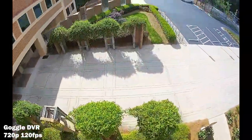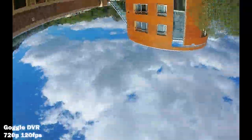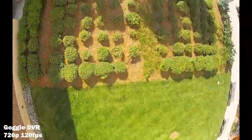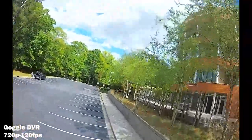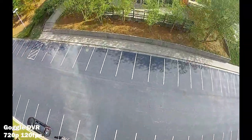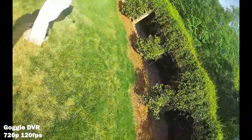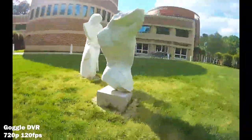After updating the firmware recently, I noticed a few new features, including ranging mode. Ranging mode allows these goggles and transmission system to estimate how far away your drone is — and it's pretty accurate. I asked Caddx about it, and they said because the transmission is essentially light speed, it estimates how fast the signal travels back and forth between the goggles and quad. So two meters away reads as two meters, forty meters reads as about forty meters.